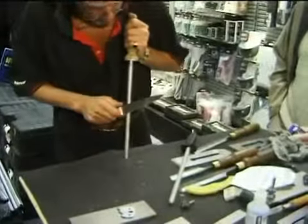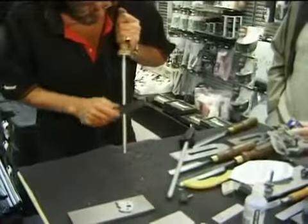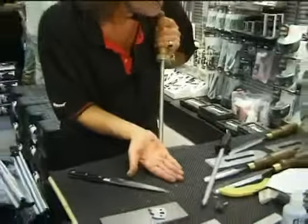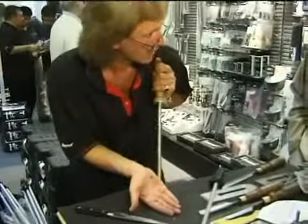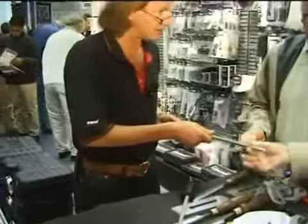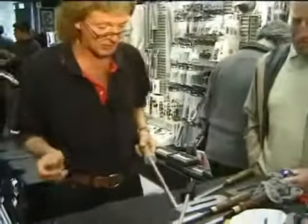So in a circular motion, we would just take this blade down the length of the steel. And I'm going to do the same on the other side. You would only do this method to your knives once, because you're only going to have to re-shoulder them once. So that's what I've just taken from the blade. It's quite surprising how quickly these cut. And if you just feel that, again, you wouldn't think that that would do anything. So it's no pressure, none of this battering about.